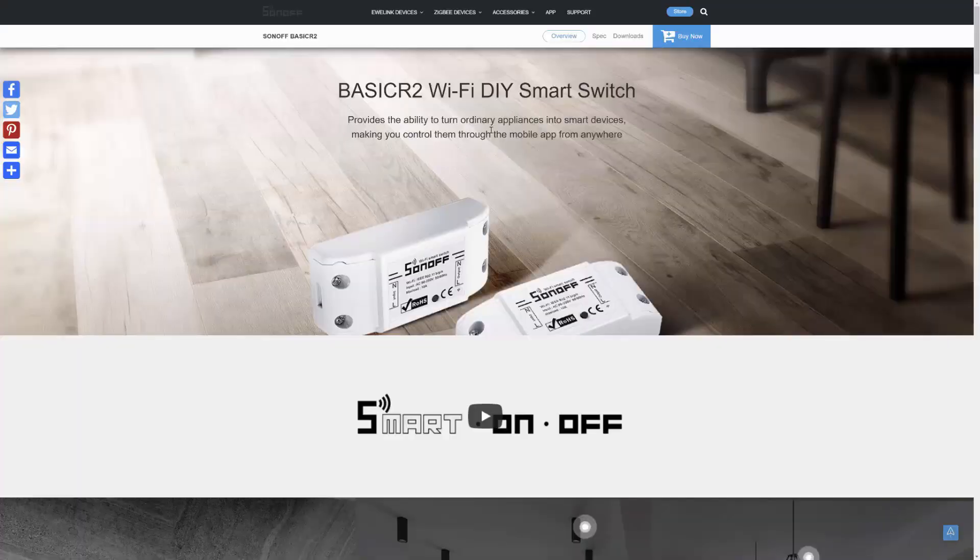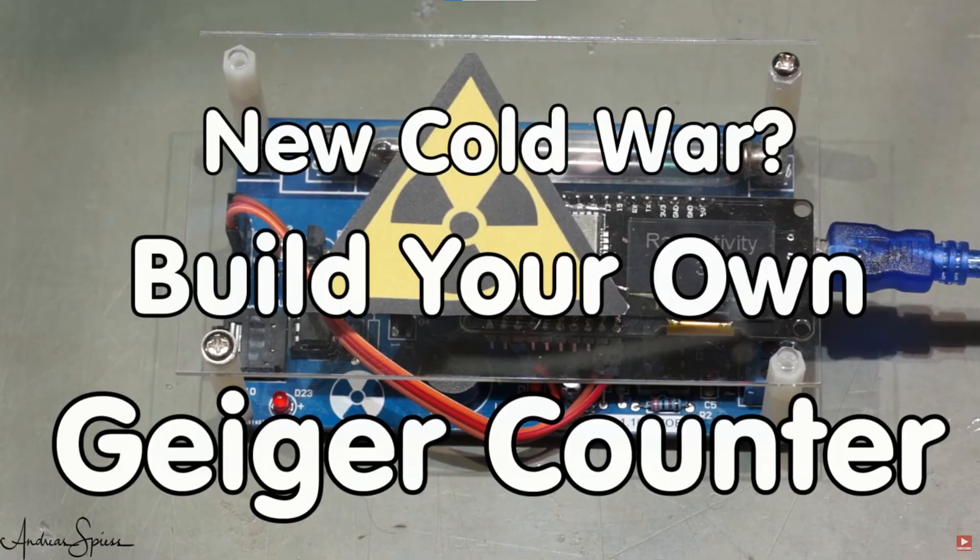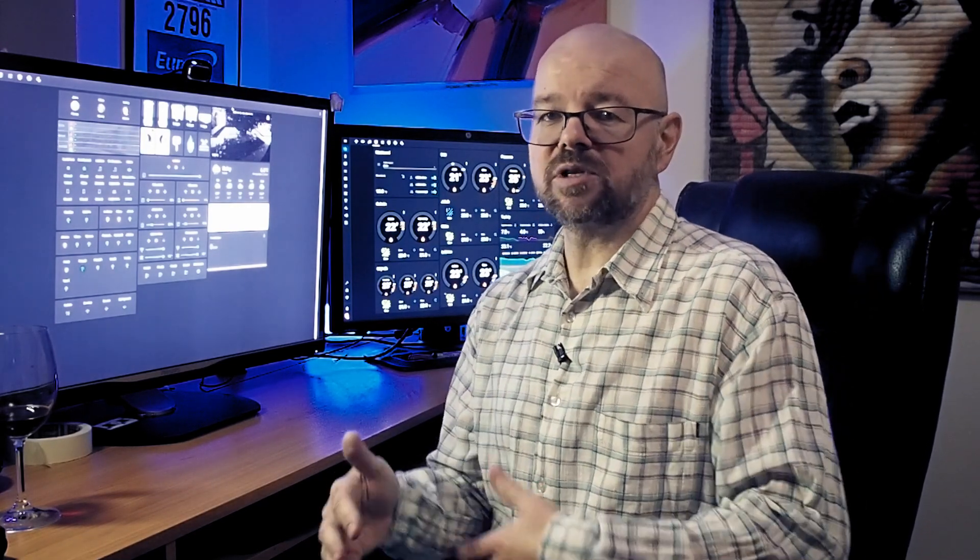Most of the Wi-Fi sensors are smart switches, smart outlets, or power meters such as Sonoff or Shelly, and obviously various IP cameras or IP devices. Or if you like to have fun, you can buy an Arduino board with an ESP microcontroller and build your own device, which I think is the biggest advantage of Wi-Fi remote sensors, because those libraries are available everywhere.